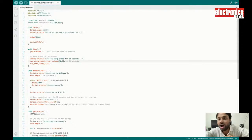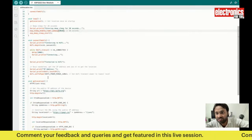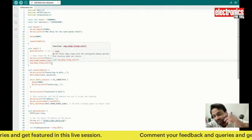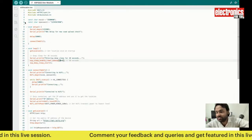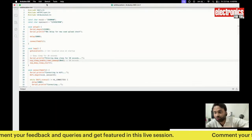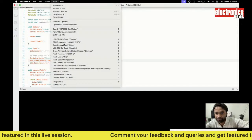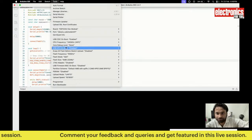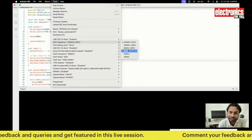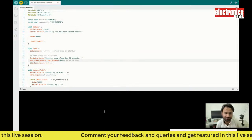So how our code will flow is, we connect to the Wi-Fi, then get the location, and tell us the location, and then go into sleep for 30 seconds, and then again wake up and show us the location. So let's upload this code. I am uploading this code. Right now I am using 240 megahertz. You can use 80 megahertz as well to consume even less power from the chip.